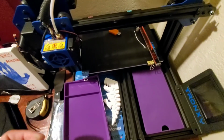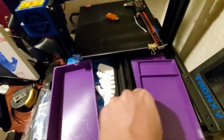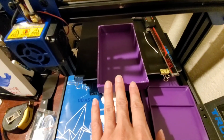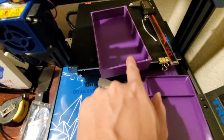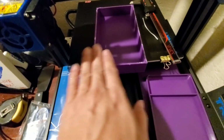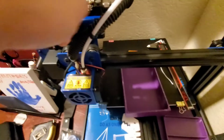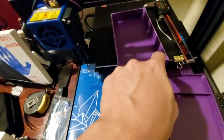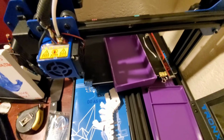And then the other time the Z-axis didn't go up, and that's what happened to this one. It was printing and it just stayed where it was, printing over and over and over, and then it just got taller, but the Z never moved up and it just kept hitting the model. And then the extruder is making a noise because the filament couldn't come out because it was just on top of the print. And I don't know what's going on.